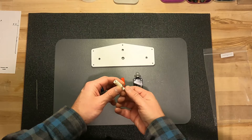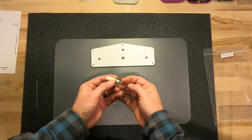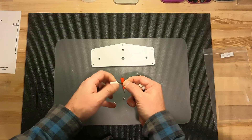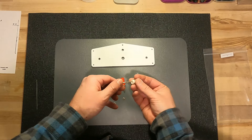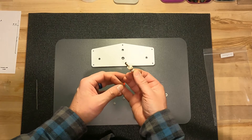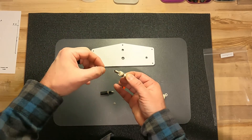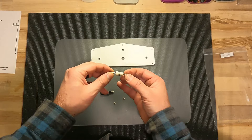Most likely you're going to remove that cap unless you're using banana plugs. You just want to unscrew these two small jam nuts, pull it out, and unscrew it — it has a little washer on there. When you place it back in, it looks like what you're used to seeing. You can clip on the sides, but I prefer to go on the top with the alligator clip. It has threads there so it gives the teeth something to grab onto, and it's not as opened up as the standard clip style.